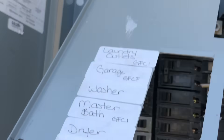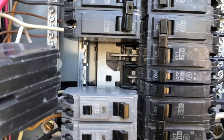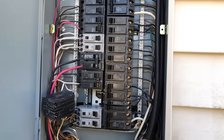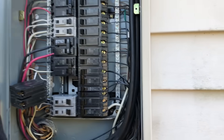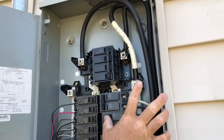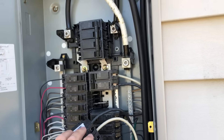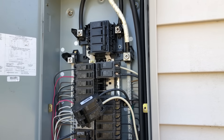Today we're starting the install of our 1450 adapter charger — my buddy's just pulling up. First we're removing this panel and pulling this 40-amp breaker to find out what type of bus connector this panel has. Some of the newer breakers only fit certain bus types, and some older panels only have that bus type from partway down. We're pulling some breakers off to double-check — and we don't have those slim bus connectors.